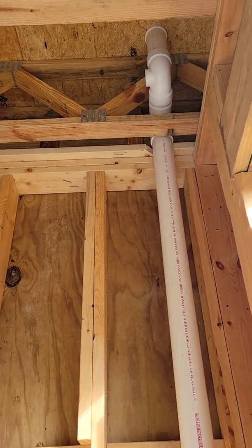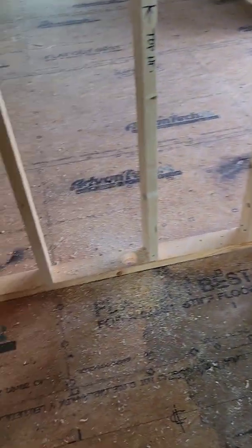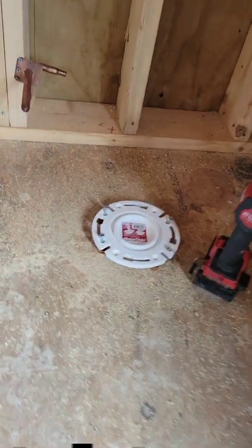You can't wherever you are — maybe you can, maybe you can't. This is upstairs, there's the shower. We're gonna vent it with this lav. Trick for any beginners: the subfloor is about seven-eighths down, seven-eighths up — build up for tile and then set. We just put PEX rings around the flange, and always use flange screws. Don't cut your hole too big — keep it nice and tight, no wiggle.